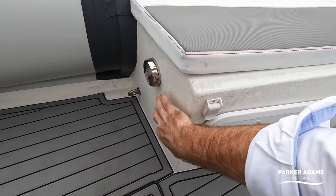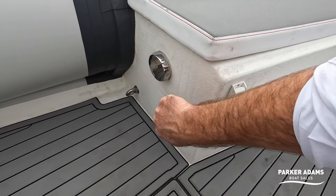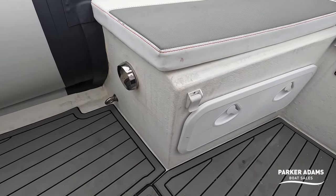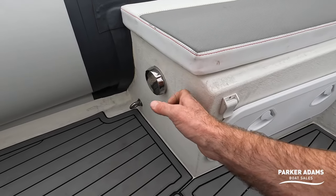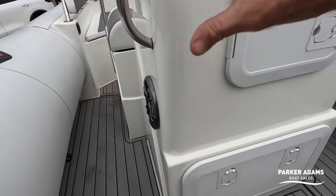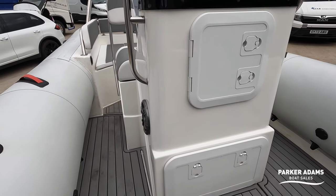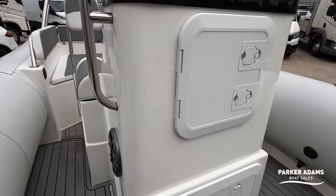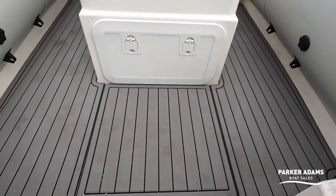These hull mouldings look a bit rough, but this is actually how commercial boats are built — very heavily laid up. Knock on it and hear how solid it is; it has to be like this to prevent cracking under heavy seas. By contrast, the centre console mouldings are lightweight, made to add extra speed but not as robust as the hull. This is your mix of leisure and commercial: most normal pleasure boats have top mouldings like the console, not made to this commercial specification.